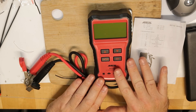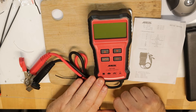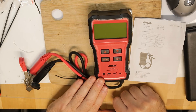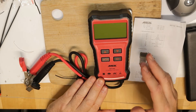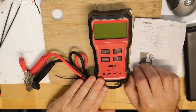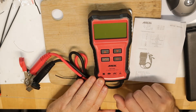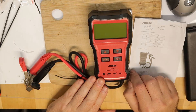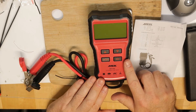I've never opened one of these devices, but I'm familiar with the theory. What you should basically do is use a high-power MOSFET. These days you have MOSFETs that can conduct a pulse of 1000 amps or even more for a short period of a few microseconds — close to one millisecond. Maybe there are a few in parallel, with very thick wires to conduct the current.